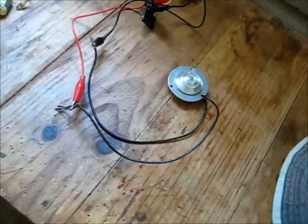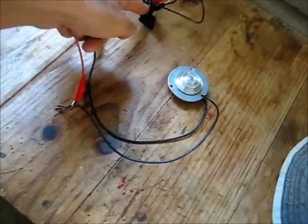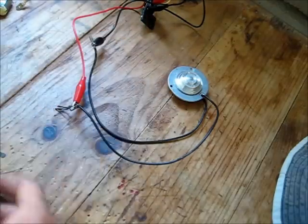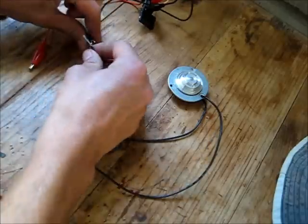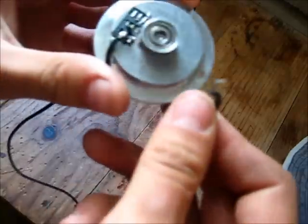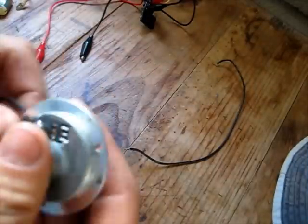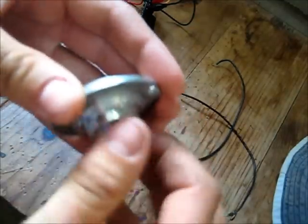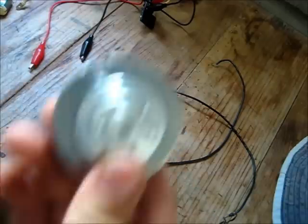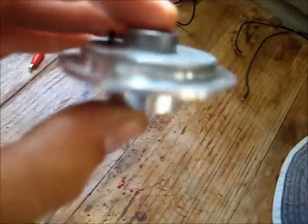That was about, I think it was 70 volts input. So that's probably, I didn't measure how much that was higher. I'd say it probably went to 80 volts to pop that. So let's just assume that popped at 80 volts. That didn't hold on very good. Yeah, pretty damn hot. Yeah, it doesn't pulse very good either. Normally they pulse when you spin them. This just spins nearly freely. It's gotten that hot. I'll see if I can punch this center part out, show you the windings. So yeah, we'll do an autopsy on that before we move on.